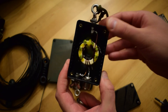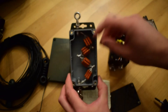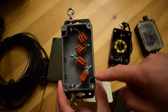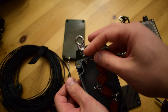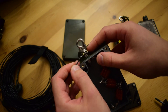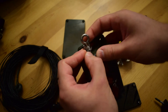I'll open this one up and show you how the seven-turn 9-to-1 transformation ratio is done. That's how it looks inside — I'm using magnet wire, and it's one, two, three, four, five, six, and seven turns. The antenna wire is about 0.25 millimeters, so it's a pretty thin one, and it has an aramid core in it for strength — I stripped it but wound it back on itself for extra durability.